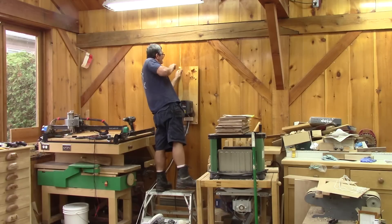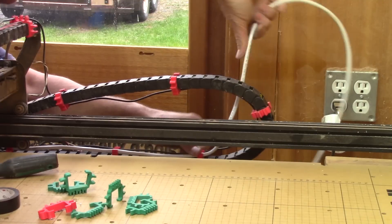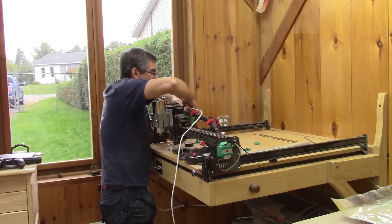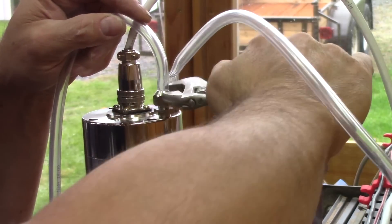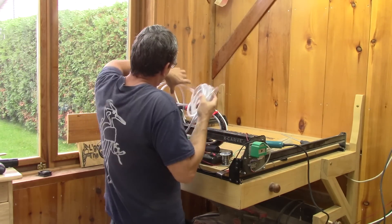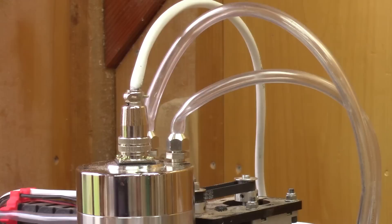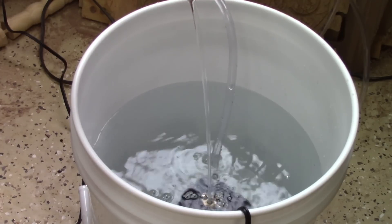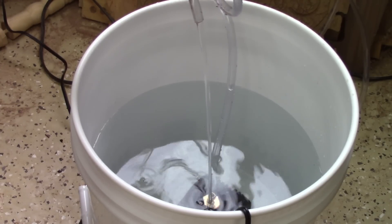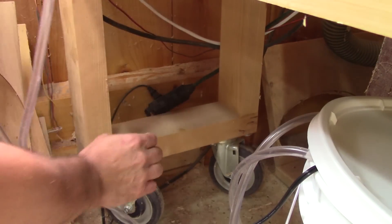I can screw everything to the wall. After putting the power cord in all the small clips that I've printed, I can plug the power to the spindle. Since it's water cooled, I need to put the hoses in place. I can use the new clips I've just printed and clip the hoses to them. Both hoses go to the floor. I just need to fill up this bucket — when it's three quarters full, I can put the pump inside. You just saw the water going inside the spindle for the first time. The water is returned to the bucket, and it's this water that keeps the spindle cool. I can put the bucket in place and plug the pump into the outlet that is controlled by the system.